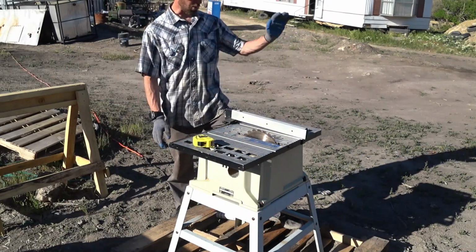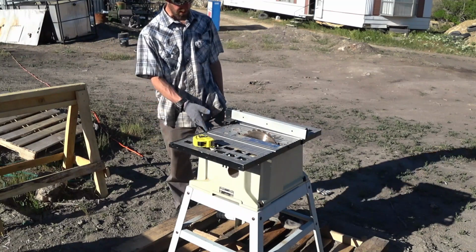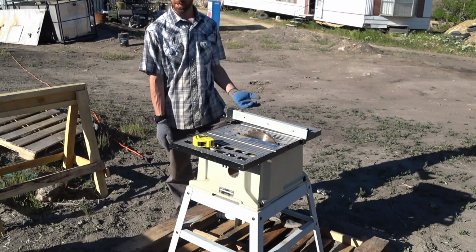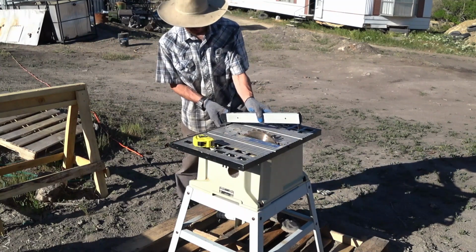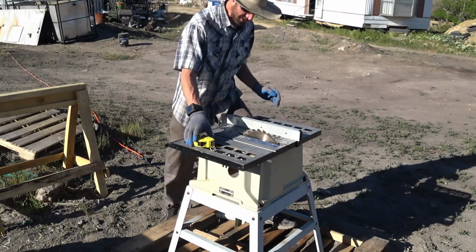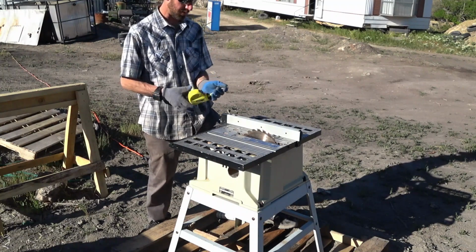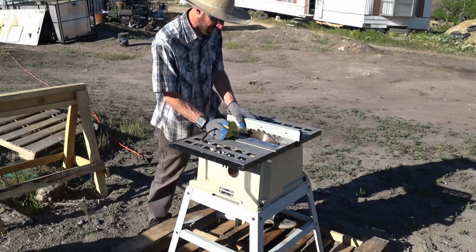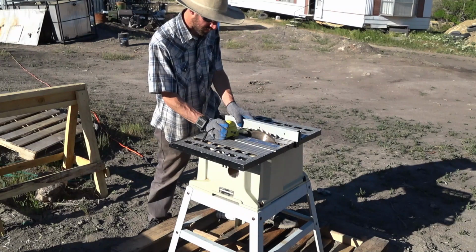And we just cut all the boards at 3 inches, except for the really flat ones. Those ones I cut at 6, because they're like 1 1/8 inch thick. They come in real handy for certain projects. I don't need a lot of them, but they do come in handy. So whenever I have an opportunity to make those kind of boards cheap, I do. 6-inch boards are usually not cheap, and obviously you can't cut a 6-inch board if it's too thick on here.